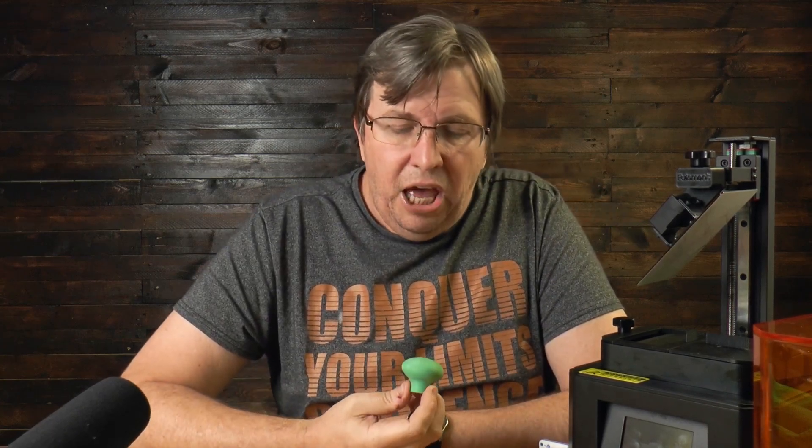Guys, be careful — especially if you've got a heavy print, your prints will eventually droop if you leave them hanging on the build plate too long. You want to try to get them to drip off, clean them, and get them off the build plate and under a UV light as quickly as possible. The longer you leave it, the more it can deform. Even if you just leave it on a desk without being cured it could deform — which is a huge pity. So guys, I want to issue this as a warning: when printing on your resin printer, do not leave it on the build plate for an extended period of time. It will deform.